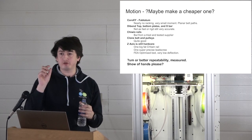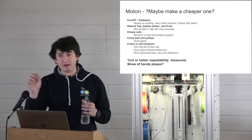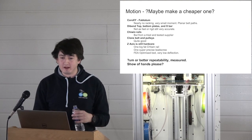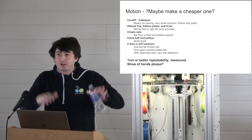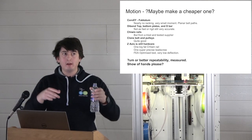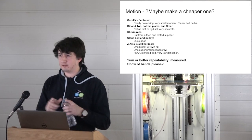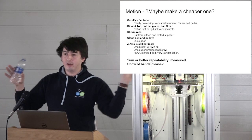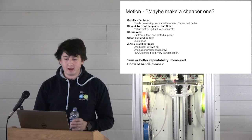Really good for structure, and they do a structural grade, which is like half a mil of aluminium, then polyethylene, and half a mil of aluminium. It's really nice and fast to machine, and it's cheaper than aluminium, so it should get costs right down. But it's stiff. It's really, really stiff, because this plate only needs to resist forces in this direction, and the stiffness of a cantilevered beam is the 4th or the 5th power of its cross section? Anyway, sheet material is basically infinitely stiff across the plane of the sheet. So like Dibond or aluminium, it's all going to be fine.